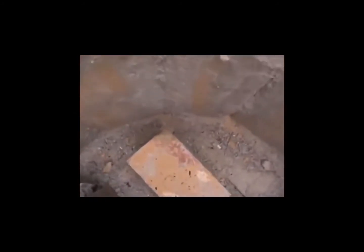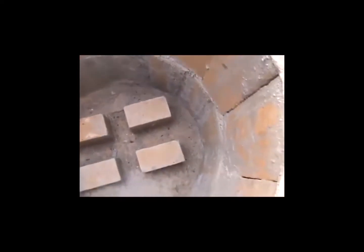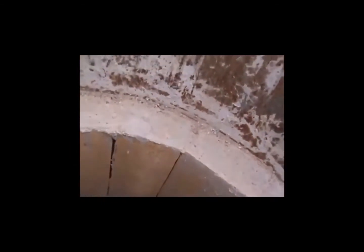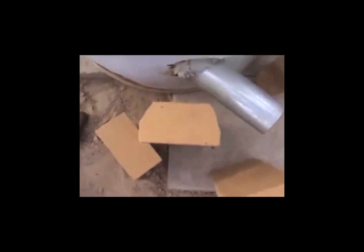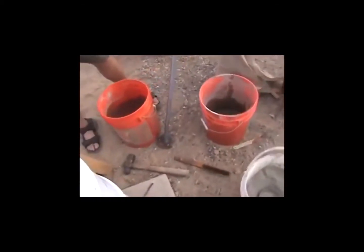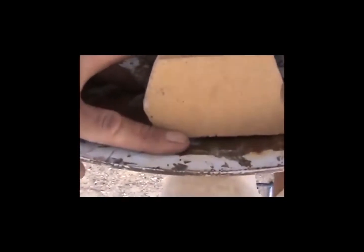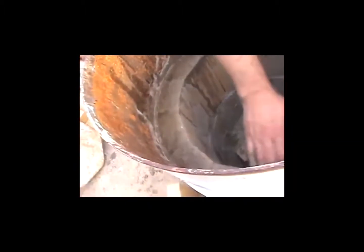You can see how we have it going in. I'm going to break out that corner a little bit more, and then the jet of fuel should break up pretty good. You can see we've chipped out and lined up all of our brick to kind of slide in together. That's not going to slide in real good, but that's why we've got the refractory cement. We're going to put a layer in there and it'll give us a nice clean rim all the way around so we won't be cutting ourselves on sharp edges.